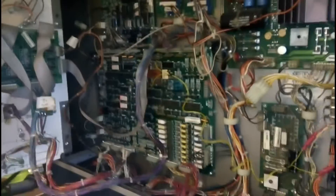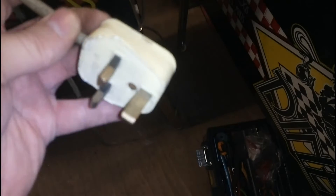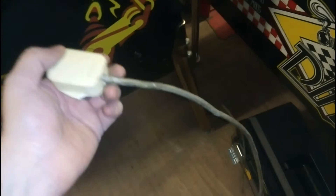The battery's connected up now. I've traced out everything else and made sure it matches the manual, apart from what's connected at the top — I'm going to leave that for now. Displays are connected up, all the battery board lighting is connected up. Last thing to do is check out the mains lead, which is pretty horrible — that's going to be a PAT fail. I'm just going to check out if it's actually safe enough to plug in and test the machine. It's definitely got bulges and it's a definite PAT fail without even testing it, you can just tell looking at it. The plug's a bit messed up as well. I'm going to make sure at least the earth is good to all the metalwork — this is all tight, they've got a decent fuse. It's looking really ropey. I've got a reel of cable still in here from the last machine I was rewiring, so I'll probably end up putting a new cable on this — it is looking pretty scabby.